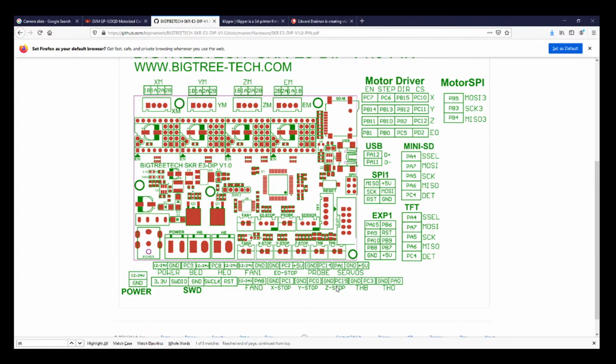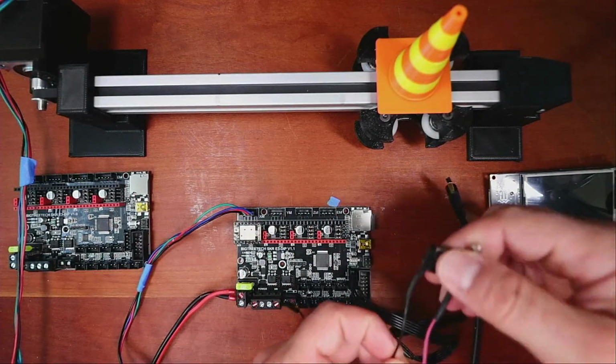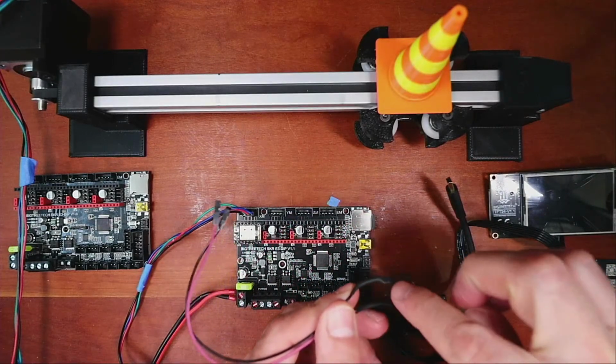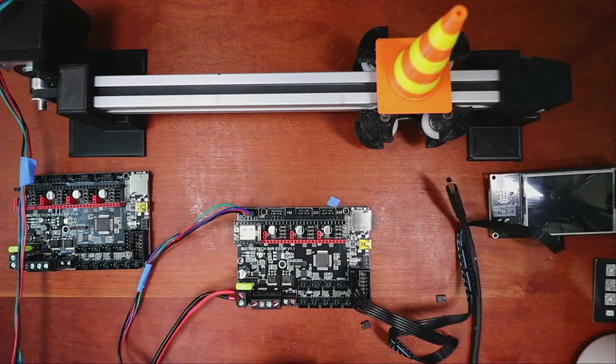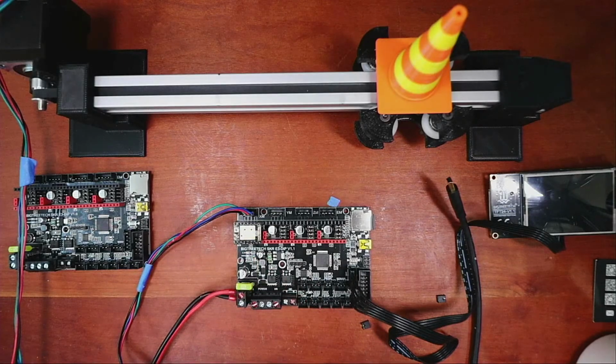So here's the end stop we're gonna use. So I'll move over to the workbench so you can see. So essentially it's 2 wires wired to it with DuPont connectors in this case, just so you can see, and then it creates a circuit from here to here when depressed. So I'm going to try and figure out a safe way to do this, so I'm probably going to put some putty down in a second. But first I want to hook up the actual power. So we're going to use the red wire as signal and the black wire as ground.